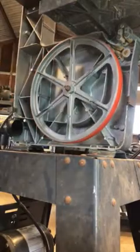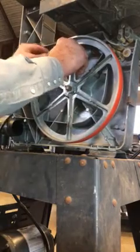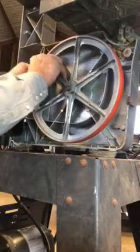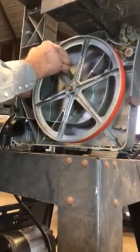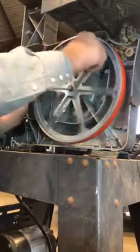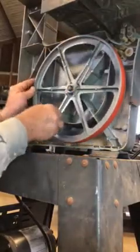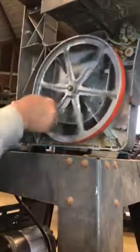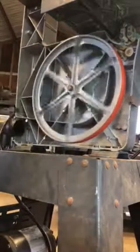Drive your drill out from under — and if you drop the washer, it doesn't work right. Now you just go and snap it in the groove. I hope you took the time to clean your groove before you started — I didn't mention it, but this one was clean. This tire fits in here really nice. I didn't disconnect the electric motor for this — a little bit of a drag, but this method works so well it really doesn't matter. That's the fastest, easiest possible way to put a tire on a bandsaw. Didn't have to pull the wheel. Now throw the belt back on and we're good to go.